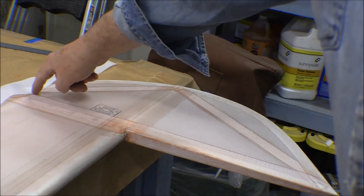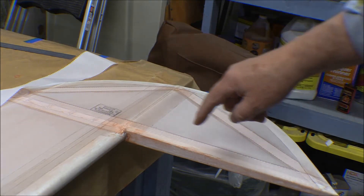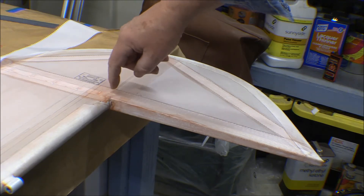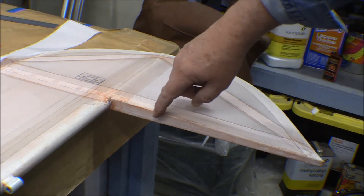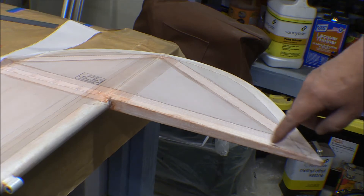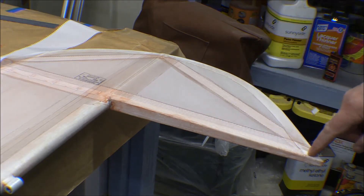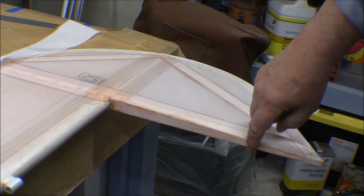I took this last rib and all the ribs over the top of the reinforcing tape — I've got 2 inch finishing tape on that. This last one I run the 2 inch tape all the way out to the end of the rib, then trimmed it around where this bar comes in, where this rib meets this bar. I took the bottom and folded it over with the iron and glued it down. After folding it over, I turned the iron up to 350 degrees and came along this edge and shrunk it so it tapers — I didn't have to cut that finishing tape. I did the same thing on the top side.